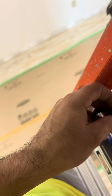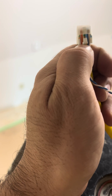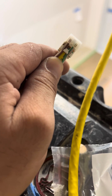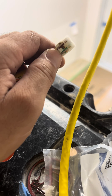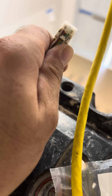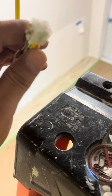Right now I'm going to show the cable side by side: white-orange, orange, white-blue, blue — and the other side is white-brown, brown, and white-green, green. The cable should be side by side. You see this piece of rings right here. When we put it inside to the jack termination tools, they will press this piece of gold metal to go inside to these wires — four on each side, four on the other side — they go inside the wires.